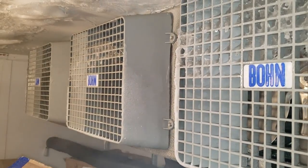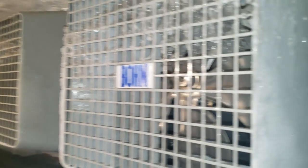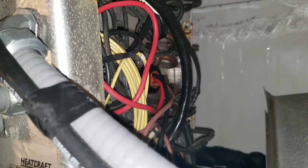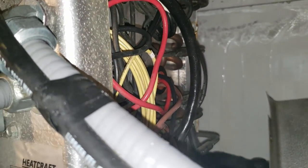We're going to get these cleaned off and reduce the defrost down to four, possibly three, and see what we get from there. Our sight glass is full, the time clock was holding temperature, it was fairly newer — looks like they changed it back in October 15.